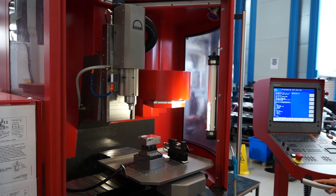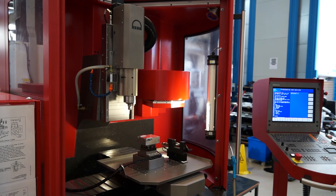It's about being realistic in the goals that you're setting in the first place. And then number two would be the environment — without doubt. Not having sunlight on a machine, having doors open by the machine, having vibrations in your machine shop that will affect what the machine is trying to achieve. Because at the end of the day, we're trying to achieve a goal of a micron or a couple of microns, and they all count up to influencing what you can achieve.